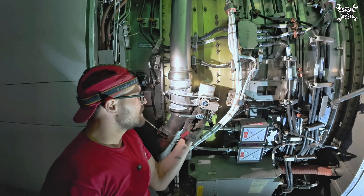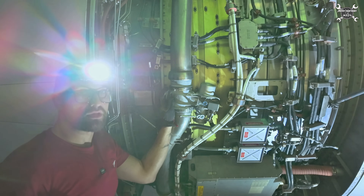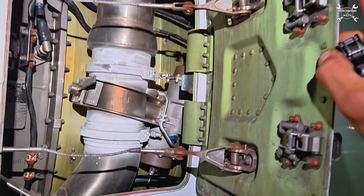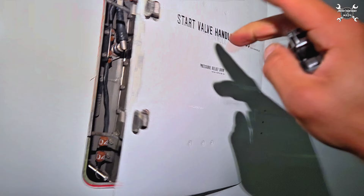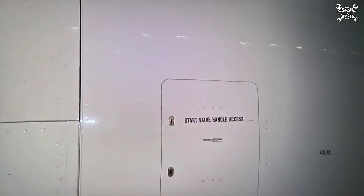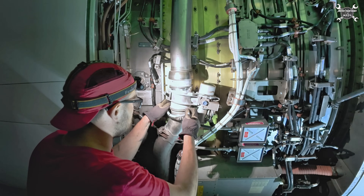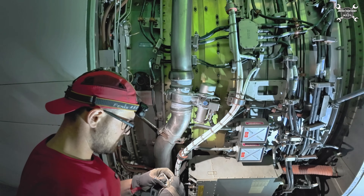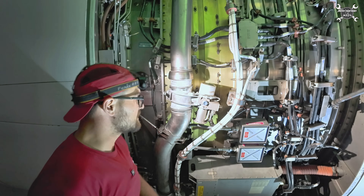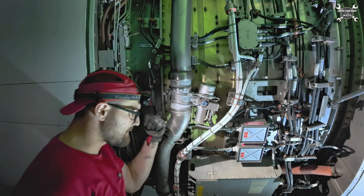This valve can also be faulty, and for that purpose we have a lever with which we can open it manually. On the fan cowls there are doors — you need a quite big glove to prevent yourself from burns, and you need to be in communication with your colleague via headphone connection. Whenever you get info from the pilot or your colleague that the engine is at required speed, you release the handle and it will close. You close the door and the engine is running. So you have two possibilities: either it will open automatically based on the command from the airplane, or you need to do it manually by lever.